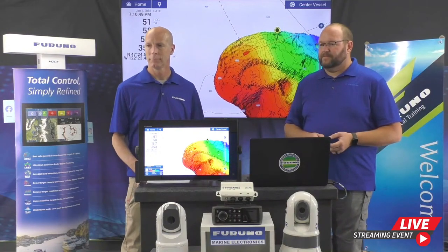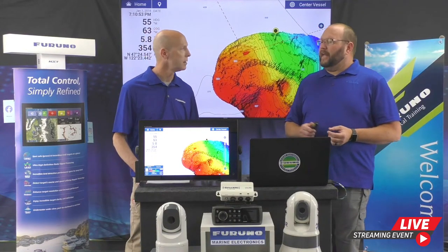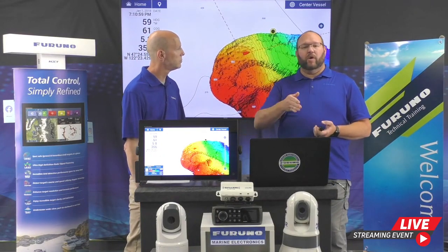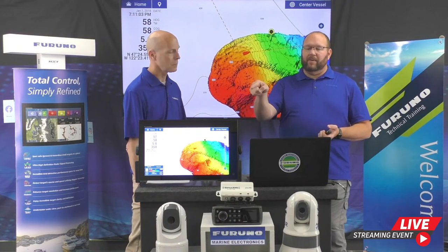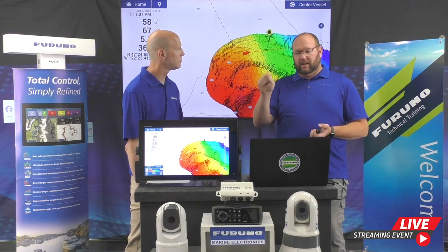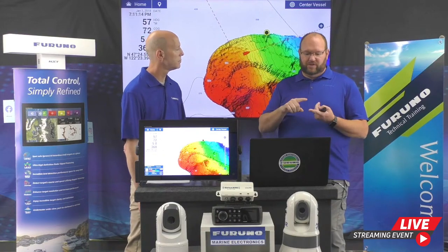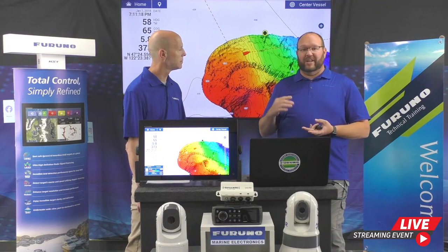Does my TZT3 automatically update to its new software version? It does not. What we do, all the software we put out is freely available to anybody. So if you go to our website, www.furunousa.com, type in your model number and click it when you see it pop up, then click the tech support or new support / tech info button. There's a software tab, takes you right to it. You'll see the software that can be downloaded freely and step-by-step instructions that are really clear.